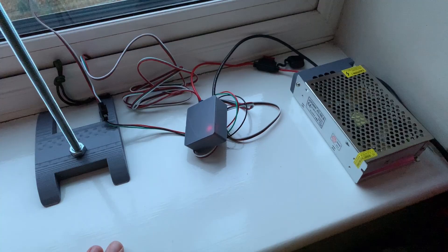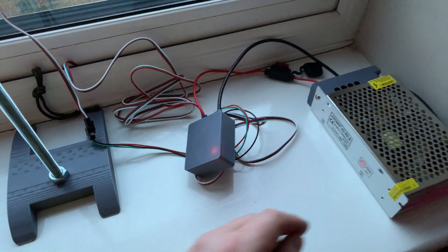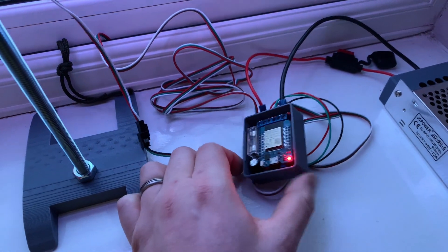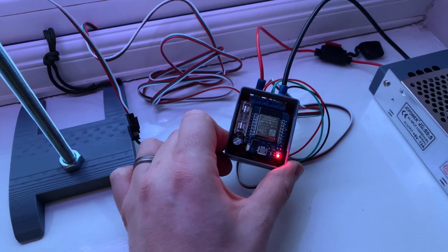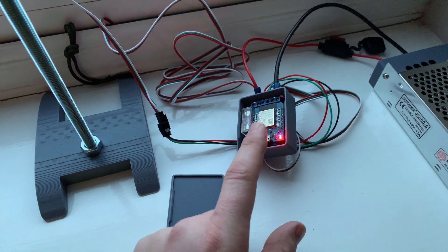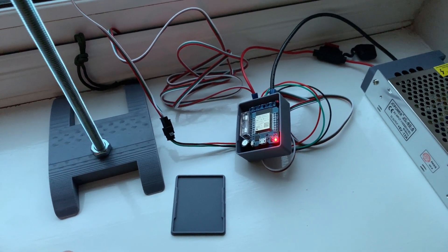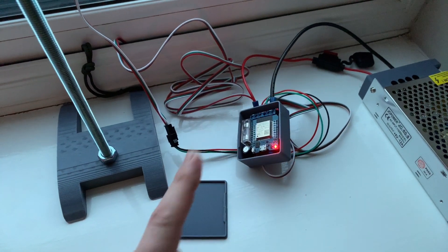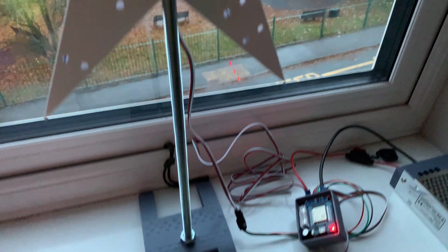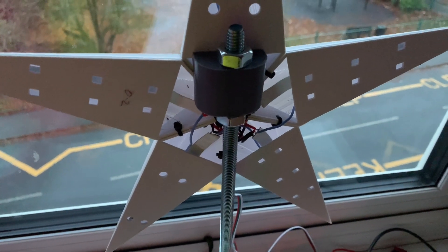If it isn't, I'll just bridge it or I'll replace it. The top floor window is powered by this 60-watt 5-volt power supply — so that's 12 amps — with a fuse there, and it's controlled by another ESP32 connected to this Mottram Labs board. I'll put a link in the description below. It's got two outputs that you can use in WLED with WS2812 and WS2811 LEDs, so this is controlling the lights around this window and also this star which is in the window up here on this bracket.